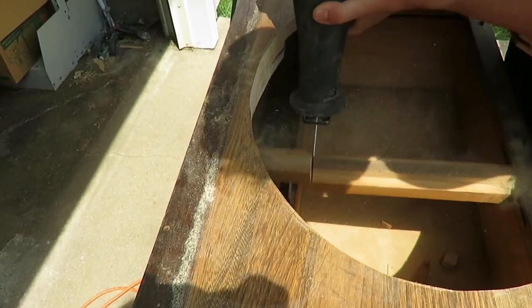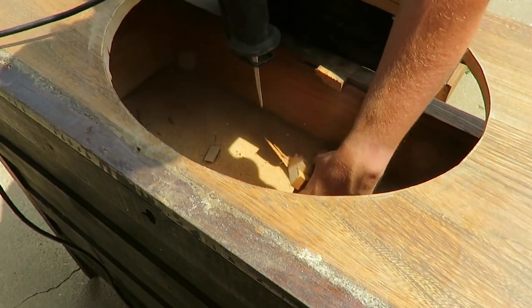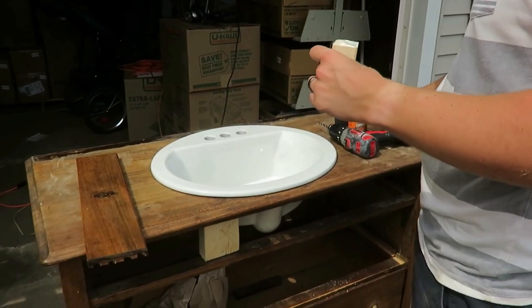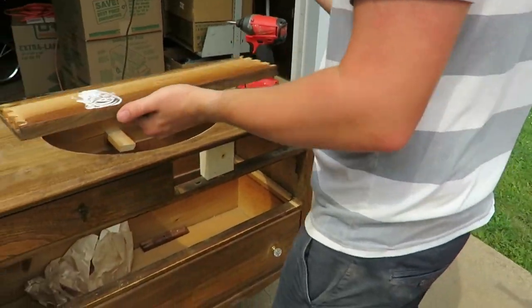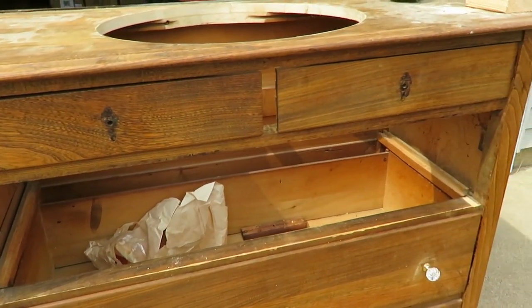You'll notice there are two little drawers on the front. To make the sink fit, we had to pull the fronts off the drawers and make them faux drawers. We put little 2x4s in the back and screwed those drawer fronts on, as well as wood-glued them, to make them look real but be faux. Those two faux drawer fronts also added extra support for the sink since we removed the original drawer structure. I still need to find two knobs for those top drawers.